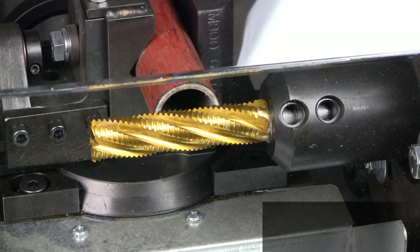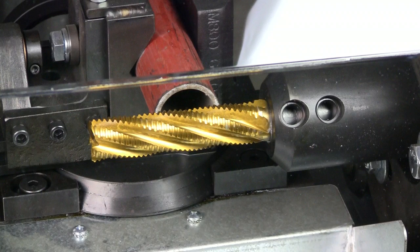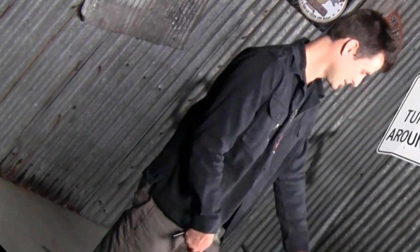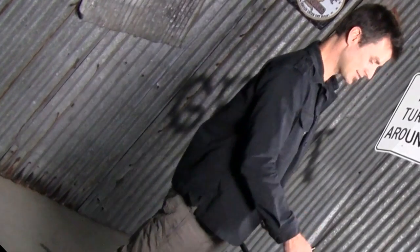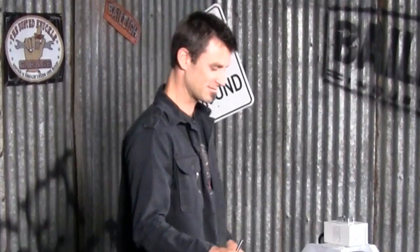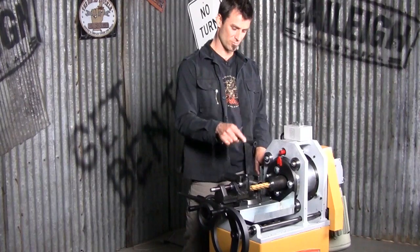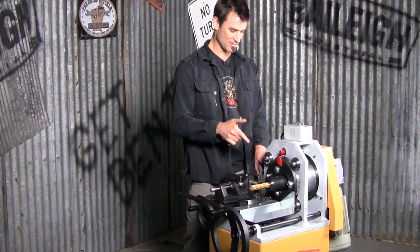Now the first time you look at this thing, you might think it'll make a one inch end mill notch — wow, that's a really impressive tool. No. That's not what it does. What it does is yes, it uses a one inch end mill, but the beauty of it is, if you come around to this side over here, it will actually do from one inch all the way up to three inch with the same end mill. How does it do that? With an eccentric.